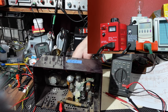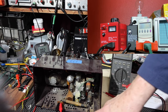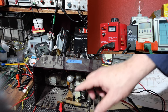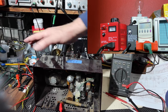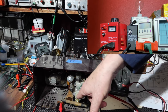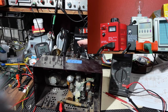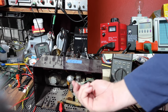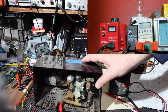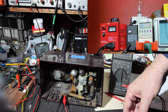the radio. I have the radio turned off. One of the things you'll notice is that since this is a hot chassis, the screws went into this plastic case, not into the board. The knobs on the front are all plastic, and the whole thing's plastic. The way they got around the fact that you could be connecting the hot directly to the chassis is that, as long as the back was on, you couldn't touch anything that would nail you, okay? Other radios, the screws would come in through the bottom right into the chassis, so if you touch the screws on the bottom, you could get jolted. Anyway, this one doesn't have that feature. It has better isolation than most, but still not terrific.